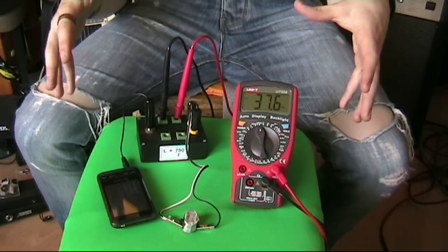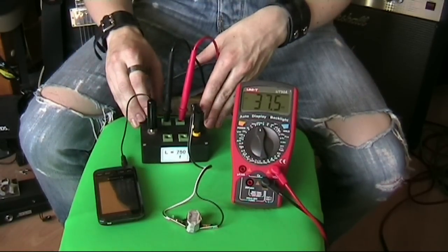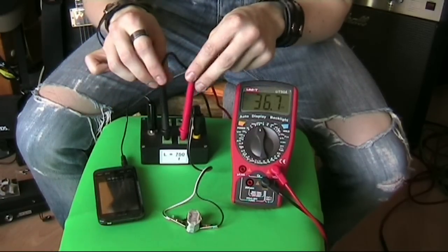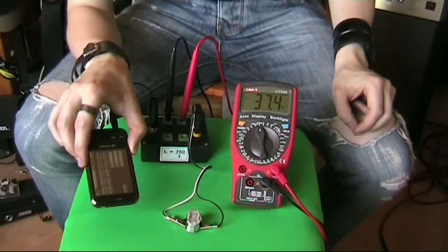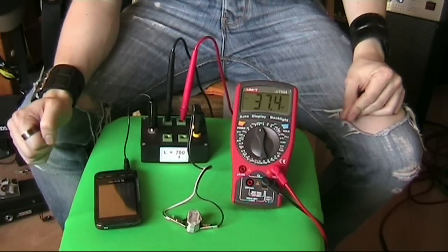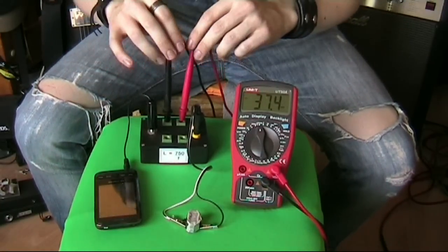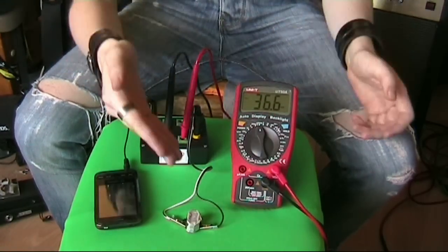Before we go any further I just wanted to show you my inductor test circuit here. So this is my inductor here, and it's hooked up to this black box. Inside this black box is a resistor — so this inductor is in series with a resistor. It's got two points where I can take these test probes and test the magnitude of the voltage over the inductor and the magnitude of the voltage over the resistor. And I've also got my old smartphone here, plugged in with a sine wave generator application playing through the headphone jack. Now, as a physicist I know that the inductance is equal to the resistance over 2π times the frequency. So all I need to do is find what frequency it is when the magnitude of the voltage across the resistor equals the magnitude of the voltage across the inductor, and that way I've got everything I need to calculate what the inductance of this coil is.